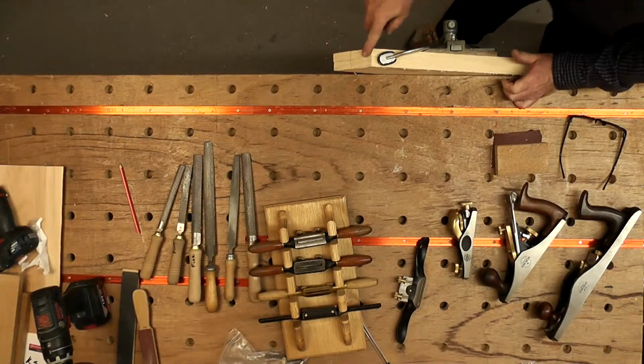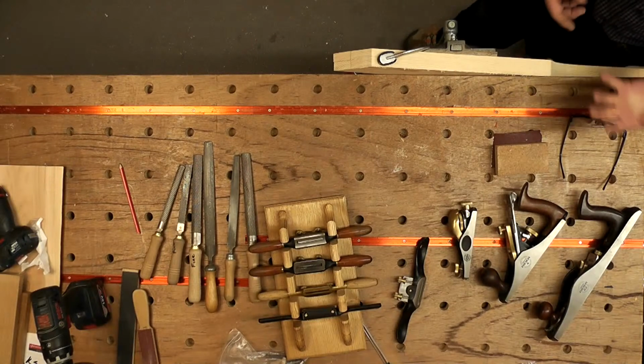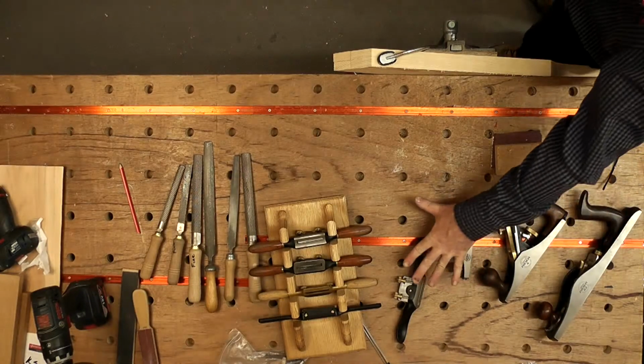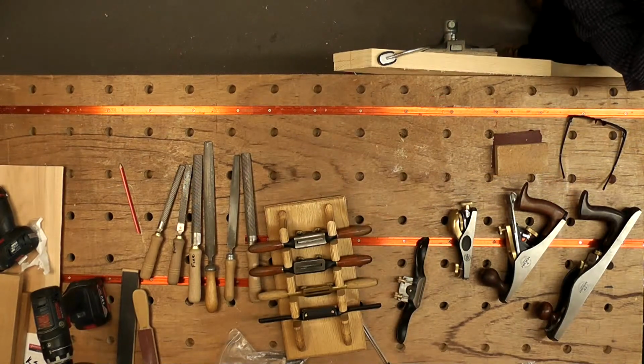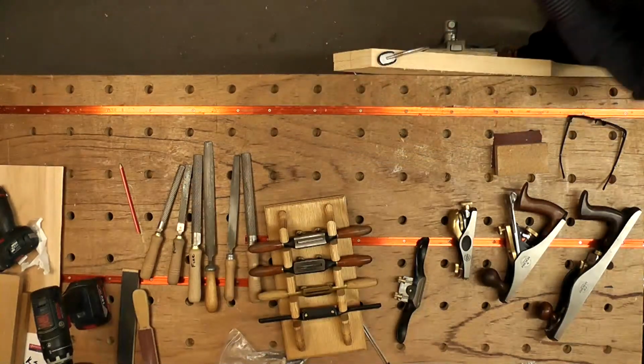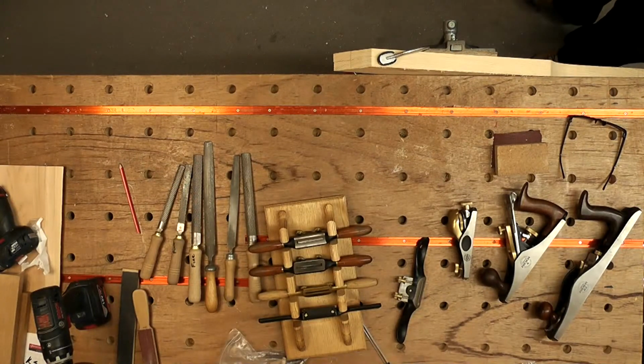That on there. I want to clean this end up. I want it to be straight. Now you've got a number of things. You've got all these things on the bench that I've quickly laid out. This goes back to those sessions that we've covered. So we've got your hand planes, block planes, spokeshaves we sharpened last week. Part of the reason for doing that was to get them sharp for this. We've even got things like the rasp, Japanese files, a whole range of different things I can use for this. Nothing's right or wrong. Go with what you have. You can use what you have, make it simple.